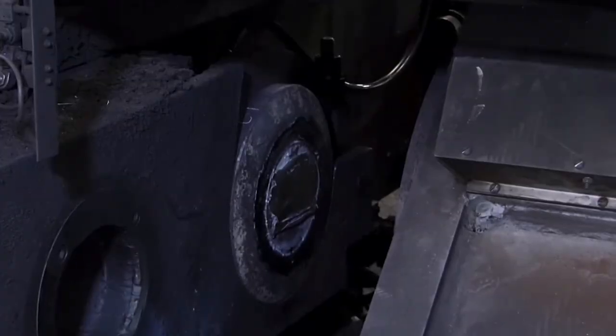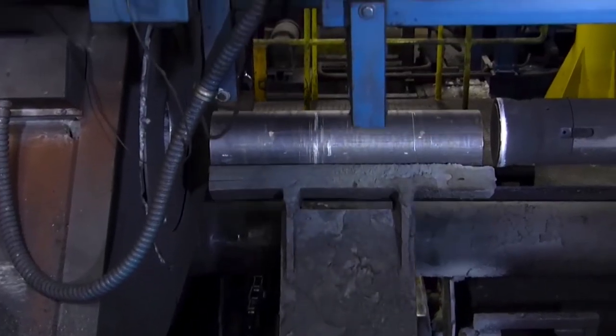So I made a mold to extrude hot aluminum, our own. We have to get aluminum up to 800 degrees. Optimal is 700 to 900. At 800 degrees, we started pushing aluminum through a mold for Scrappy's new spars. Now, what's really cool about extrusion is the metal isn't actually molten. It's not a liquid state. It's still a solid matter at 700 to 800 degrees. It doesn't go into a liquid state where you could pour it until you're upwards of above 1200 degrees.